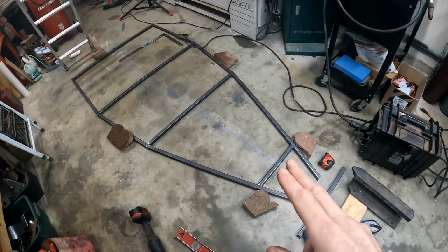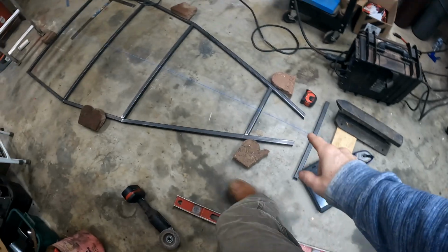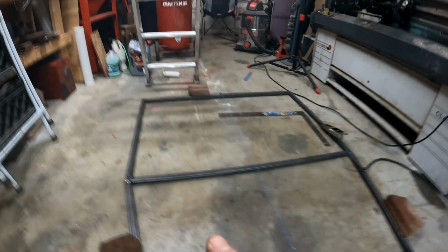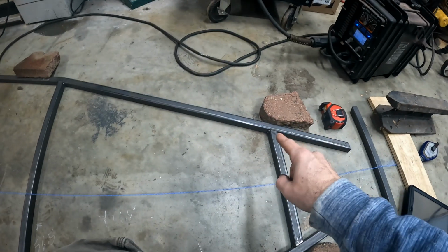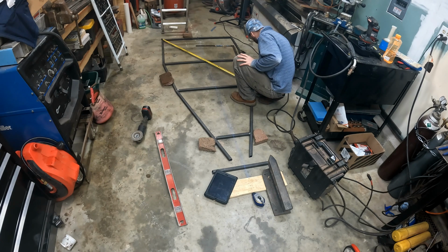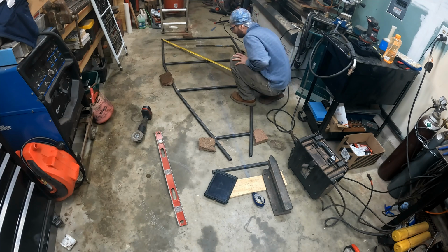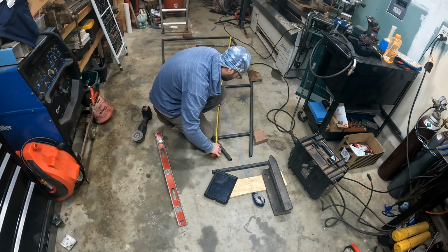So in order to get to this stage, I'm using a blueprint on my iPad. I've got the string line, but now I kind of need to do some corner to corner measurements from that corner, you know, up to this corner and vice versa. It's 69 and an eighth. This one is 69 and a quarter. So that's an eighth off. 3/8, 91 and 3/8, a quarter.